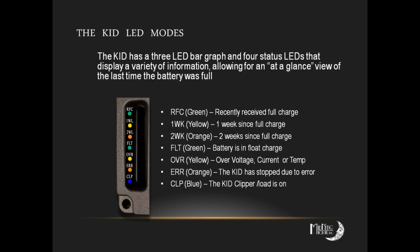Hey, Roy. Yep. I got a question for you. Any chance of a higher amp kit that could handle 2 of the latest 60 cell modules for a 12 volt system? I would say that right now the kit can actually do that. It could current limit on occasion, but for the most part, the 60 cell modules I'm seeing are like 250 to 275 watts. So unless you're in a really pristine place, it's still going to do just fine. It's not going to hurt the kit. But I would say that there are no plans for a higher amperage kit, but there are plans for other different charge controllers, right?